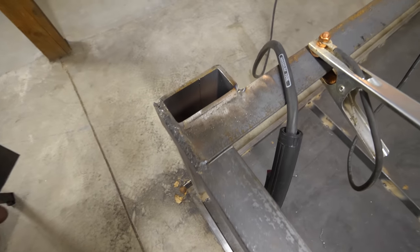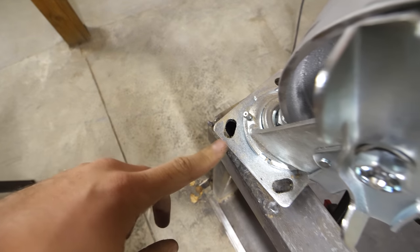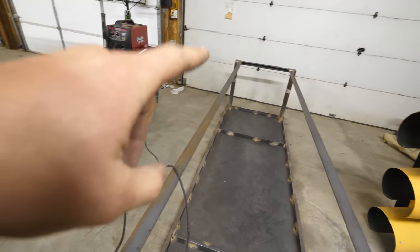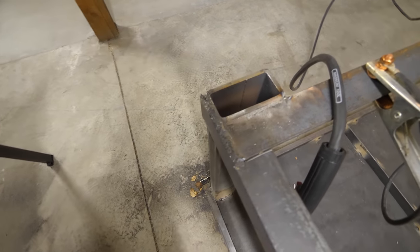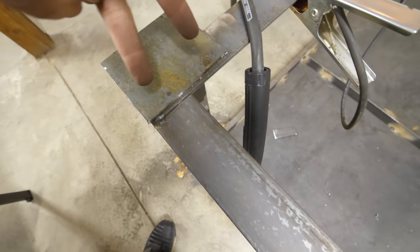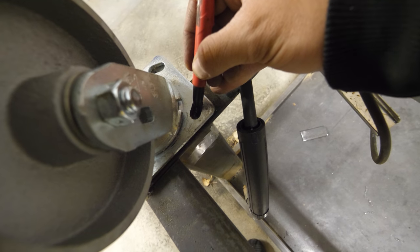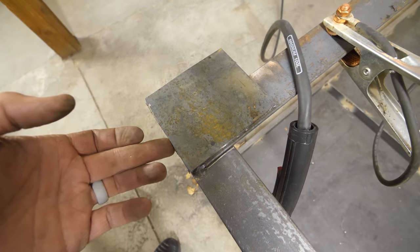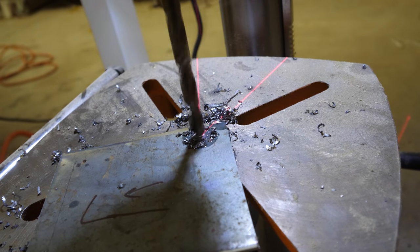Now in order to mount them in place — obviously if I just stuck the wheel on top, two of the bolts would go down in these holes. If I wanted something quick and dirty I could just weld all four wheels straight to the frame, but I want the option of taking the wheels off later. So what I'm doing is marking out bolt holes on this, drilling through the angle iron, and then tacking the bolts on the back side of the metal, setting the whole thing down into place, and putting a couple more welds around the side for good measure. That way if I want to switch the wheels or remove them entirely, I have that option later — because once you weld something in place, it's relatively permanent. Bolts, not so much.